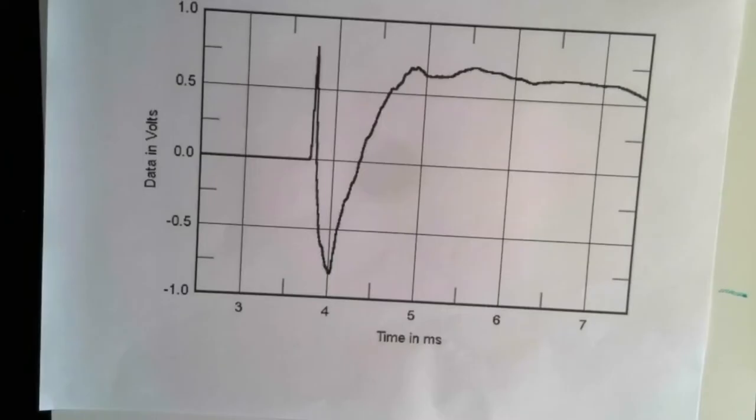When I speak of dynamics, we're not talking about loudness now. I'm talking about the difference between a quiet part of a music and the maximum SPL of a transient. In that case, first-order filters, contrary to what you read, are the most dynamic because we don't have any of that energy canceled by some of the drivers putting their energy into the room in a negative wave, as a negative pressure. So what does that mean?